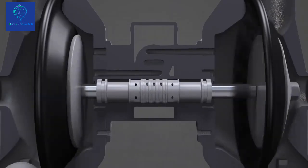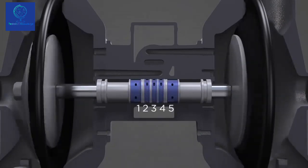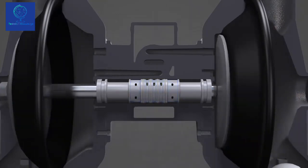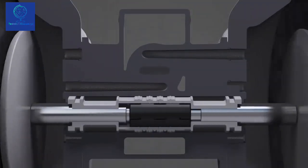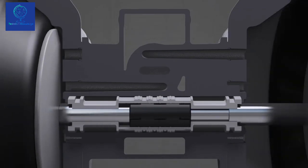The pilot air valve directs the air that moves the main air valve. It is constructed of 5 separate chambers and a central rod that moves side to side due to the diaphragm pressurizations. The pilot and main air valves work together to drive the pump. The pilot air valve has 2 logical states, which we will call left and right. Pressurized air enters chamber 3 in the middle of the pilot valve sleeve. Chamber 3 is always under pressure.